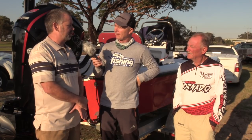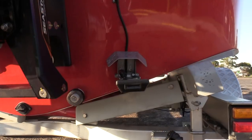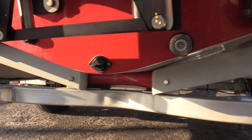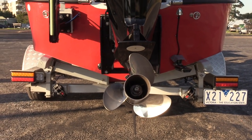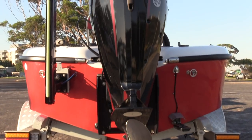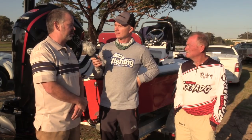Look, it's probably the size lends itself to it, because you don't have like a 6-7 metre boat, you can get away with a lot more. Deep V, reverse chine, which makes it stable at rest. Yeah, it just all works. It's just a size that works. For a boat its length, the beam is quite decent. So proportionally and balance wise, the way it's put together, the boat performs well.